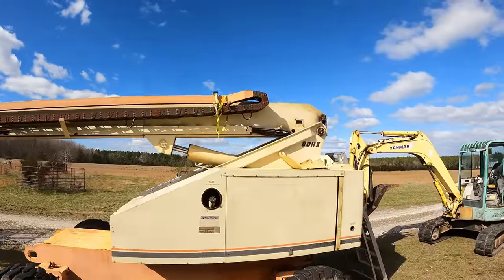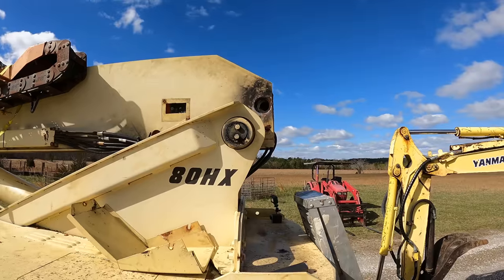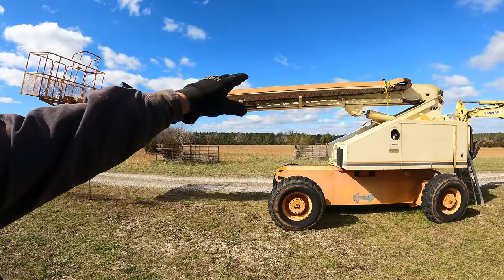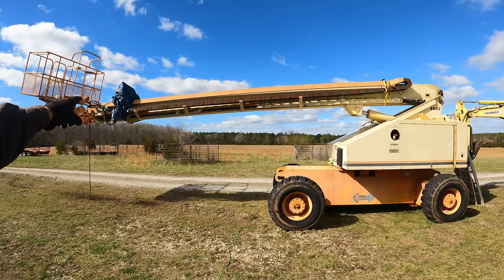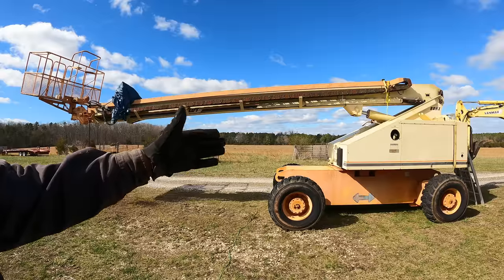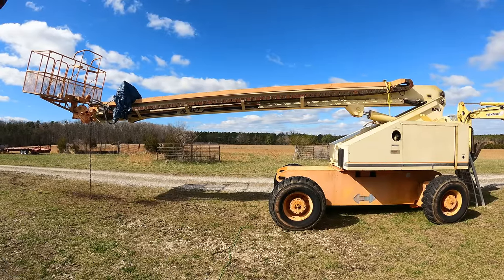All right, here's the deal. I need to get the eye of the cylinder to go forward. Remember, the cylinder is directly connected to the mid boom at those half pins that we put in already. So all I have to do is come out here and pull on the mid boom, and the entire cylinder assembly is gonna go forward. Then I can pry bar it back a little bit if I need to. That's the plan, we'll see if it works.